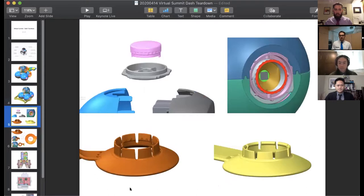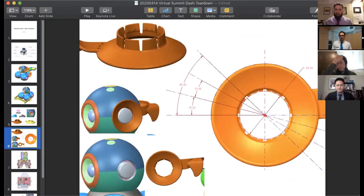Here are two detailed looks at accessory features. At the bottom, on the left, you see something that was used in the launcher. It has notably longer teeth, these flanges, and on these longer flanges, you'll notice these triangular or diamond-shaped facets. Those provide resistance to rotation, rotation prevention, actually, more specifically. Over here is the pusher bar detailed view, showing a shorter tooth and a smooth beveled undercut, and the reason for those will be evident as I show you my video and then this slide as well. I'll jump back to the video briefly here. So here's your Dash.